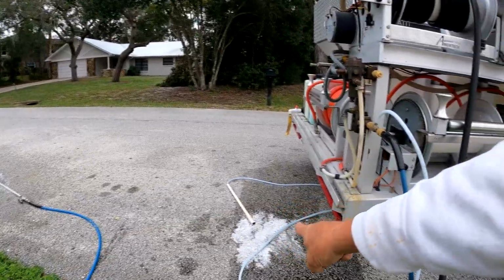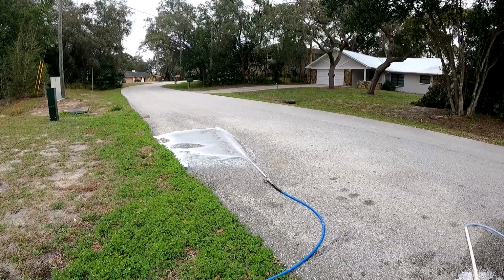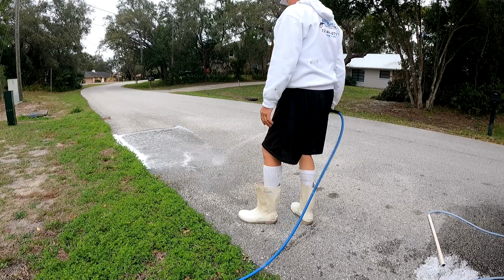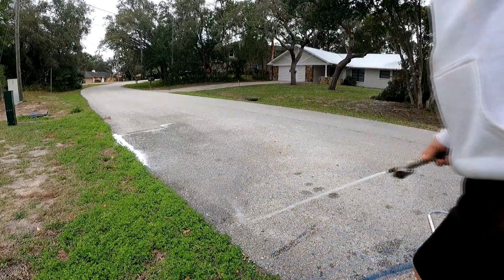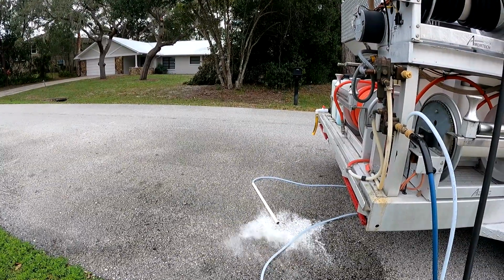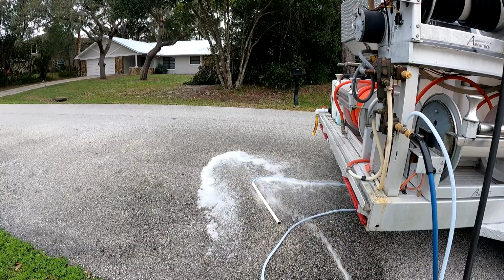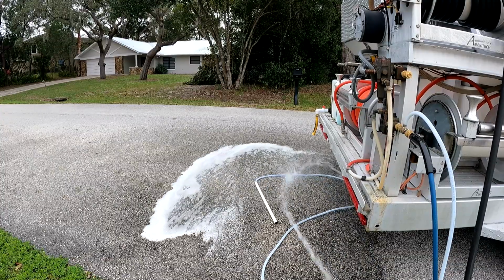Just like over here, this injection tube. Look at all the chlorine coming out of there. You got to rinse all this stuff out. All right? This is how you do it. Okay, it's all rinsed out of the line. Now we're gonna rinse this stuff off. This has been sitting down in the tank, and you want to rinse all that soap and stuff off. If you don't rinse it off, it's gonna go in that bucket of fresh water that you got sitting over there.